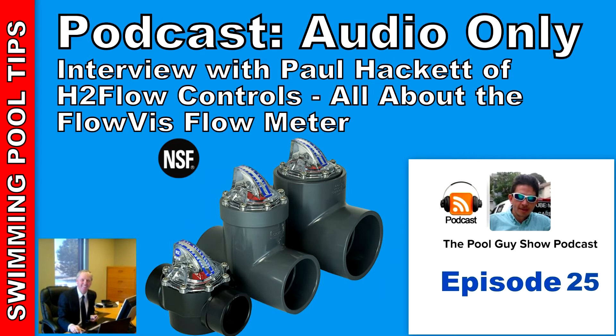Most builders do put a check valve somewhere in the pool plumbing. With FlowVis — and this is a surprising question I get asked — does it matter where you put it? Unlike pressure, flow is flow. People in the back of the bus are going the same speed as people in the front. The only real restriction we mention is where you have hockey puck chlorine feeders. Some of those can be problematic at the injection point — they can leak when the pump shuts off and leach chlorine back into the flow stream, which can be problematic for all equipment, not just FlowVis. We encourage people not to put FlowVis near the injection point of these erosion-style feeders — referred to as inline chlorinators in most areas.